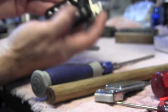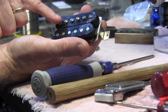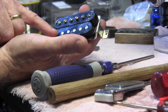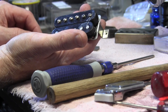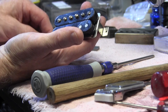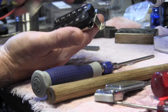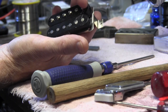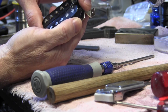Something important to remember: the south side of the magnet always faces the screws and the north side always faces the slug pole pieces. This is one standard on humbuckers — as some of you know, wiring on humbuckers is not standard when you get into four-conductor wires. So we take our new magnet with the north side headed toward the slug side of the bobbin and the south side headed toward the screws, and just push it right back in.